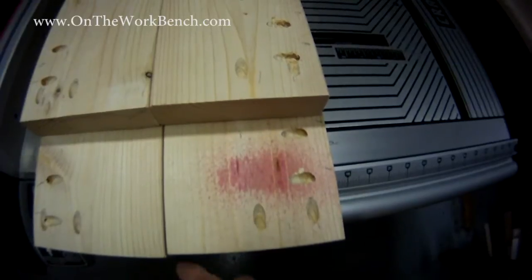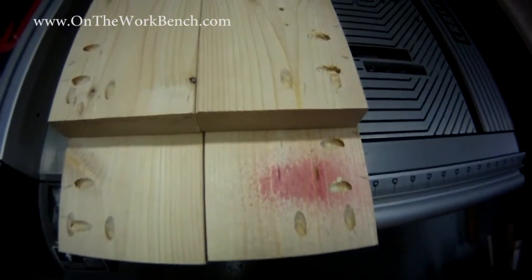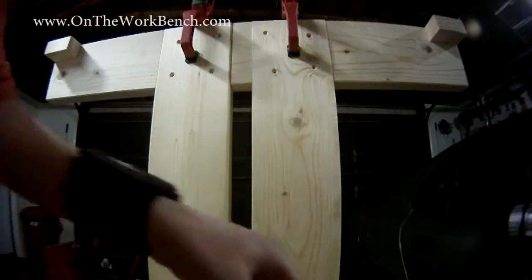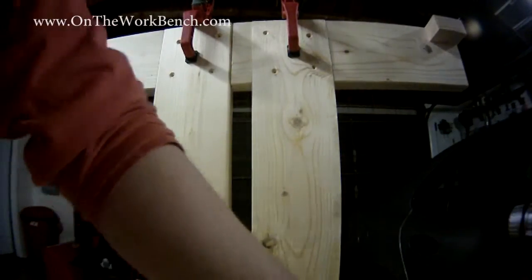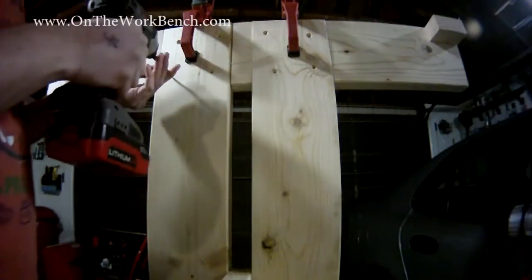Yes, the screws will have some support, but I'll have the glue there with it as well. And that'll act as a mechanical clamp. Now for the next part of my glue up here, I'm trying to put on the stretchers. I've already got glue, and I'm trying to set up the rabbets here. I've pre-drilled the holes and countersunk them. And I'm going to add some wood screws here to tighten up. I got some just plastic clamps here to get this going.